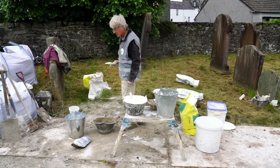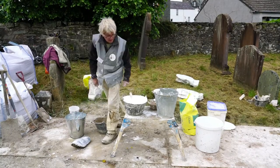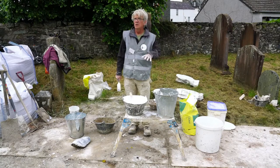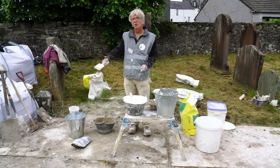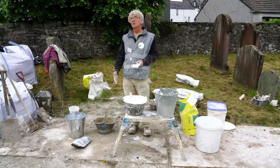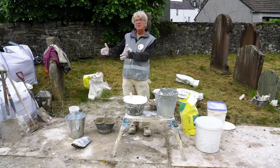And got another stone. Well, we'll top up this one with the Portland. Nigel, get a bit of a feel for how much coverage that is. How much of that gable end would that do? That would do at least half of one of those gable sides, okay. Yeah, at least, in one coat. Maybe might even stretch it to two, because you're thinning it out on the wall. The first coat's going to be thinner. But you'll see the next coat, when that's dried up a bit or stiffened somewhat, will give you complete coverage. It'll grab on, because it grabs onto the lime that's already there. They're intimately compatible, obviously they're the same bloody thing, but in a slightly different stage of setting.